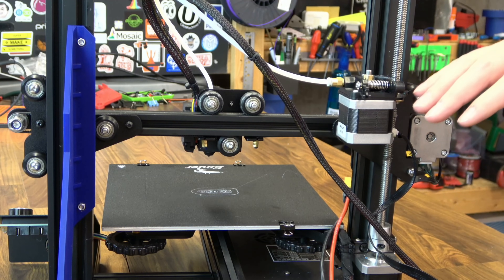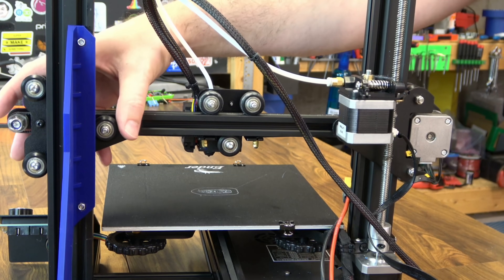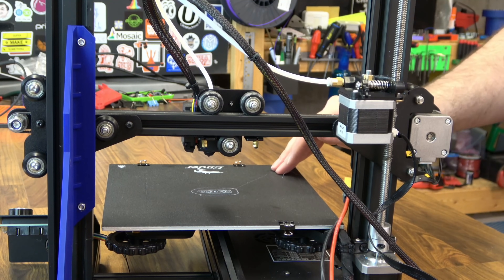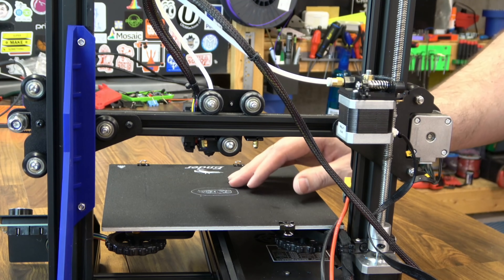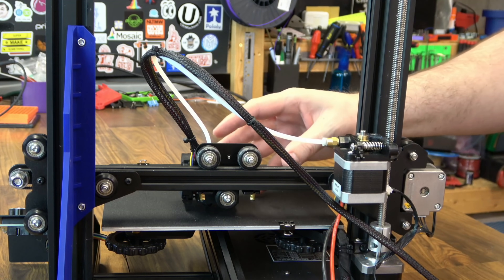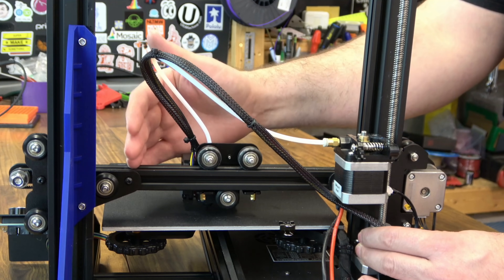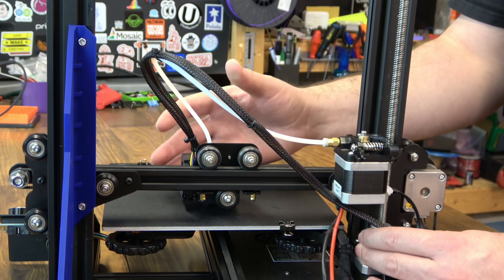The problem with only having a single lead screw is sometimes the non-driven side will droop a bit. On a printer like this with V wheels on extrusion, you can get these adjusted to minimize that effect greatly, plus you're going to be able to adjust the bed up to compensate for any side-to-side slop. If the non-lead-screw side is a little bit lower and the lead-screw side is a little bit higher, you compensate by leveling your bed. So most of the time it's not a big deal. The issue I do see on occasion is too much slop on the unsupported side — it will move faster than the driven side.